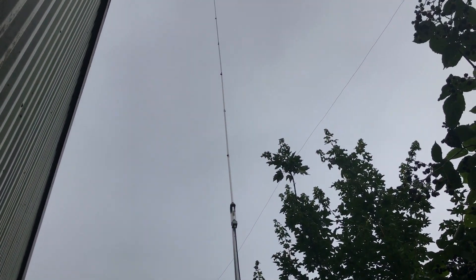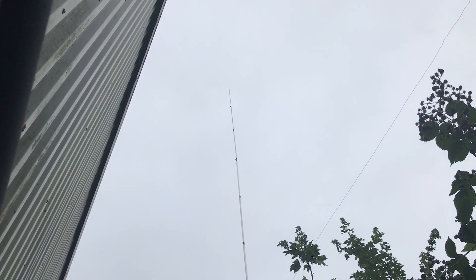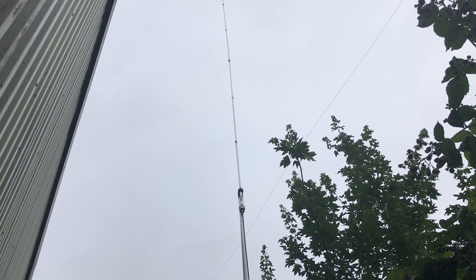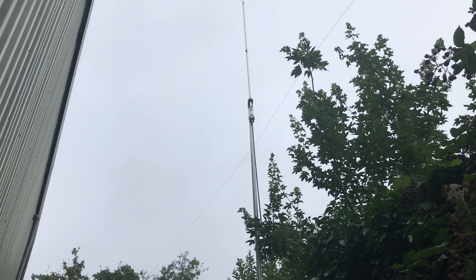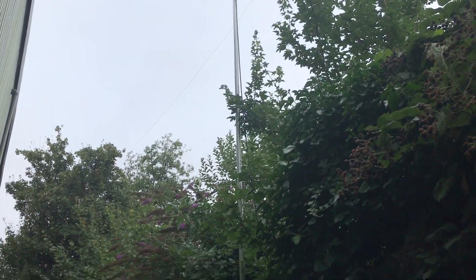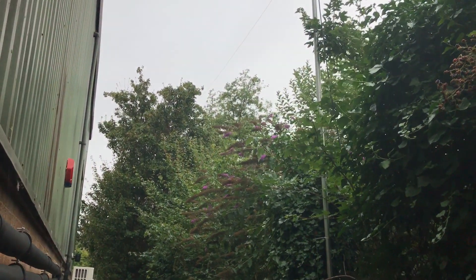In terms of antennas, I've set something up temporarily. I bought a broadband vertical from eBay — I think it was 88 quid — and it tunes from 80 to 6 meters. Some bands have to be tuned with an antenna tuner, which is absolutely right, but it does tune at 80 and at 6 and everywhere in between. All of my QSOs have been made on that antenna running 10 watts. It's pretty high off the ground — the base of the antenna is probably about 8 meters up.